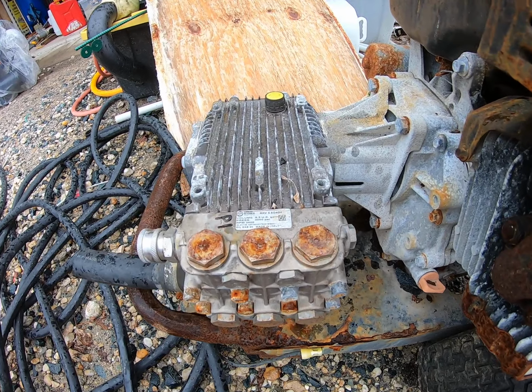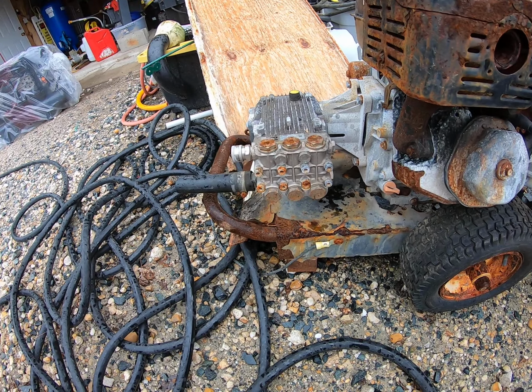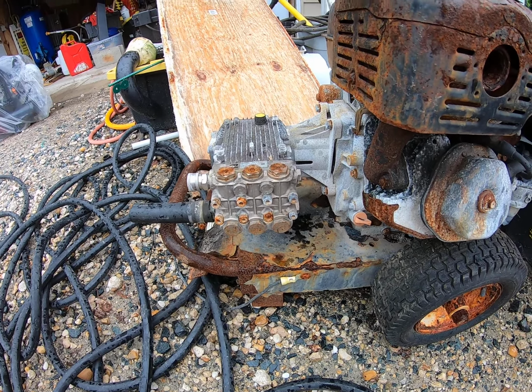Now, according to Russ, these RKVs are able to suck water even though it's a direct drive, which is often something that people will say on a very regular basis, that you can't do that on a direct drive. It won't draw water. You can't run it off of a buffer tank. We made plenty of other videos proving that wrong. Most times if somebody's having issues on a direct drive pump, not being able to get it to work off of a tank, the issue is your plumbing, not the fact that the pump itself is direct, belt or gear drive.